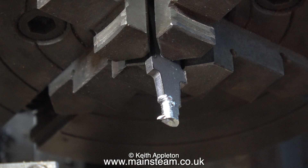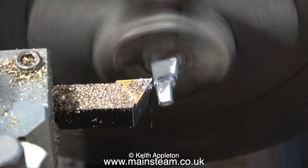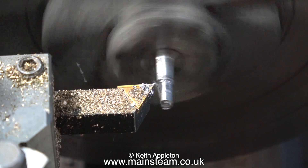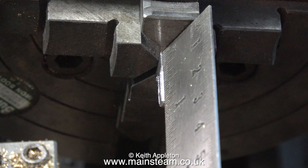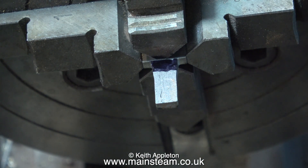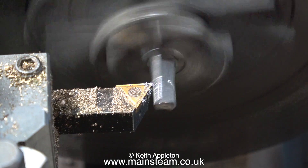Take a close look at this component. Can you see the two square parts that stick out on the tapered bit? These are not part of the brake beam. The laser-cut blank has been shaped like this so you can put it in the four-jaw chuck, clamping it by the parallel part and by the protrusions at the front. I should show surprise and say 'well I didn't know that,' but really it is obvious — brake beams are tapered towards the end and do not have square protrusions on them. A lot of castings are made like this with extra parts left on the casting just to make machining easier. Using a ruler I'm marking the position at three-sixteenths of an inch, and I've done this on every one of the brake beams. A scribed line would be more engineering-like and more accurate, but for this job the felt-tip pen works fine.